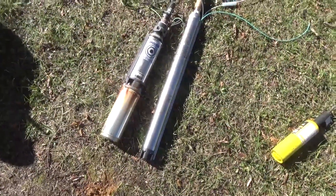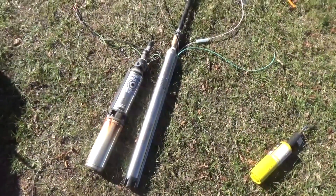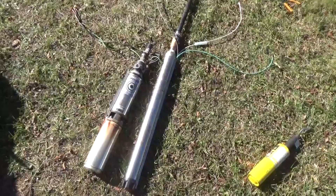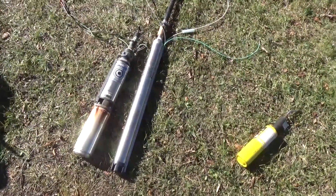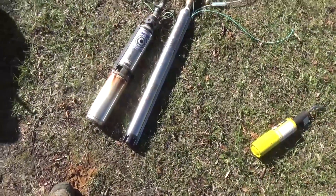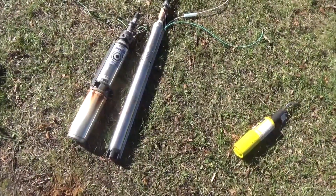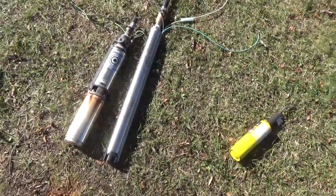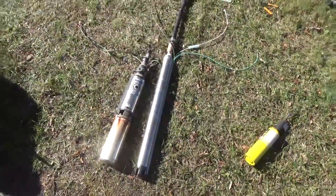This customer wants to run some loads off a solar inverter. The inverter they've gone with is 120 volt, so I'm swapping out the existing well pump for a Grundfos SQ series pump. There are three or four models of the SQ, so don't just put any SQ in there — you have to know what the total dynamic head is.